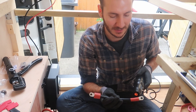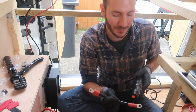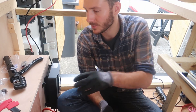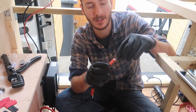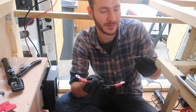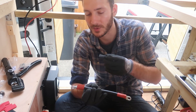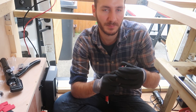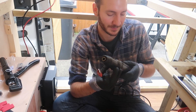We made a bit of a mistake — we put the connectors on and crimped them down before we put the heat shrink on. That meant we were struggling to put the heat shrink over the connector. Luckily we've got some bigger heat shrink that we can do afterwards. For the 35 mil wire we bought specific heat shrink, but it basically wouldn't fit over the connector. So: put the heat shrink on first, then crimp your connector.